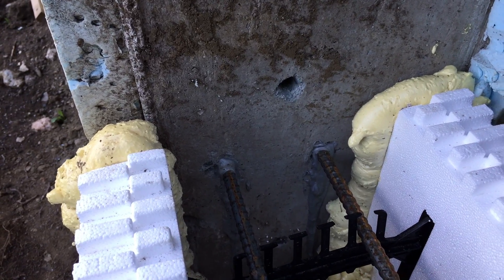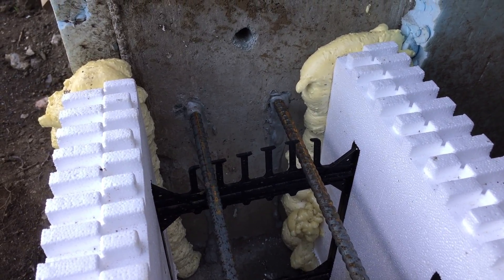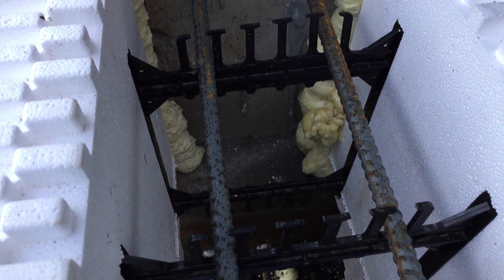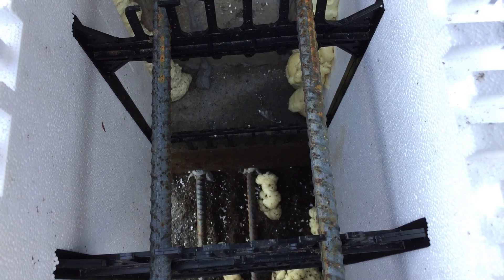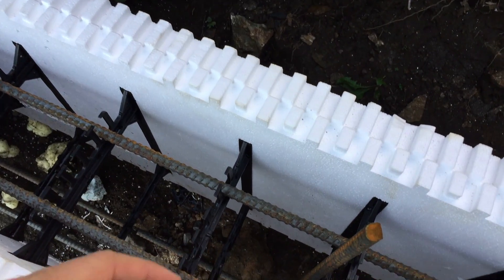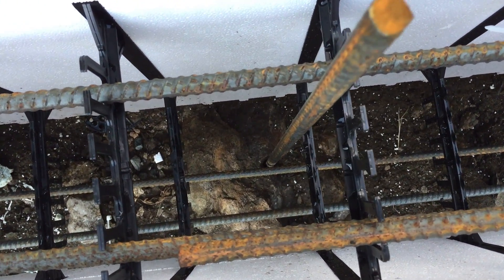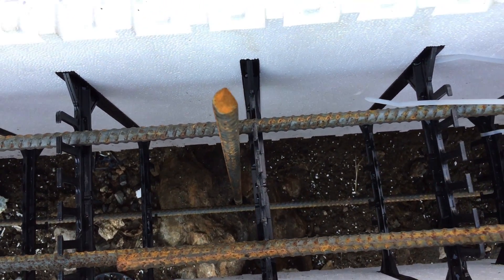This is a good shot of the rebar I've run through the form — you can see I've drilled holes in the existing foundation and epoxied the rebar in. I've done that not only up here at the top in this block, but down below as well. That's the footing steel going around, epoxied in, going around the foundation. I've also got vertical steel in some places — this one here is epoxied into the hole down below, which is going to create a super solid joint straight up through the footing and the wall.